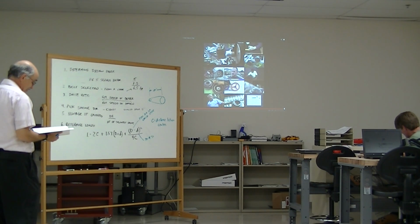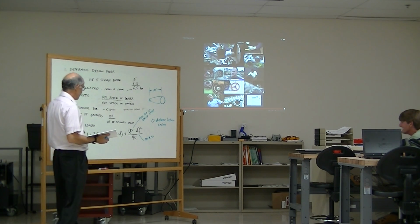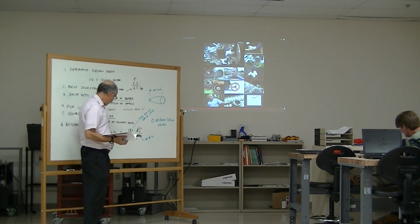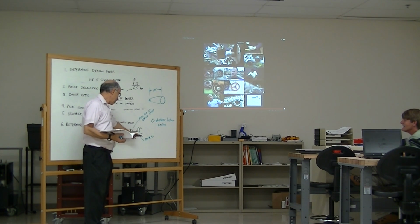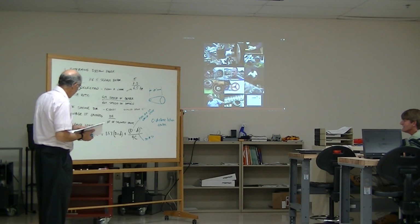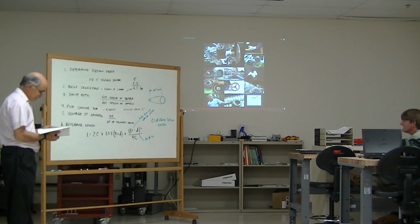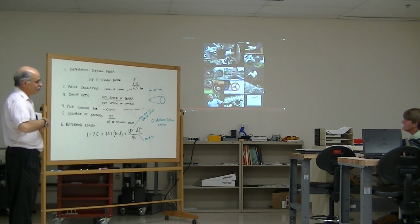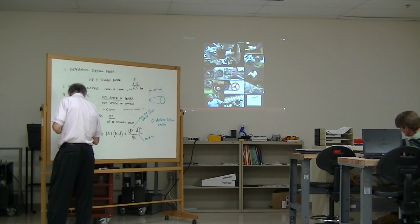Excellent. So you're gonna plug into this formula. You know, what's the distance between the centers? Take pi over two times the two pitch diameters added together plus the difference of the pitch diameters squared divided by 4 times the center distance. Now you think, okay, I'm done, right? I got that. Now you're not done. Next thing you got to determine is the corrected power per belt. So that's number 7. And this is a step that I don't always see in all these things. So maybe this is very exacting.